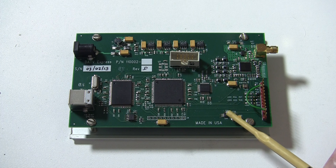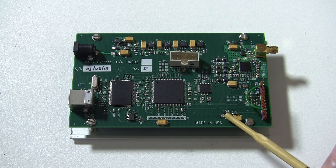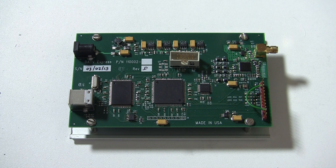We have added to the board a 2-channel A-to-D converter. That can be used for calibration and also connected to an external sensor. It can be used for forward and reverse power measurement. One of the potential uses of this would be pre-distortion of the transmitter to compensate for the final amplifier response.